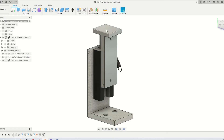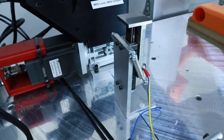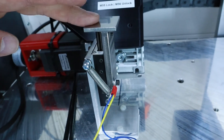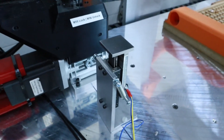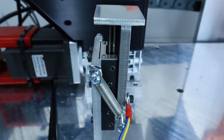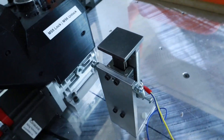It works brilliantly — simple. Machining it was quite simple. I started out with a piece of angle aluminum and a piece of tool steel that wasn't hardened yet, and just whittled away what I didn't want and drilled and tapped a couple of mounting holes. You can see how the probe wires are connected to it, the springs, the slide, and the actual contact surface has been lapped very smooth and very flat. I was very fortunate in that I got it very parallel to the machine's table, so I get consistent measurements regardless of where the tool contacts the surface. This does solve the problem of compliance wonderfully. I've taken a 12 thousandths diameter drill, flew into it at speed, and it holds up great.